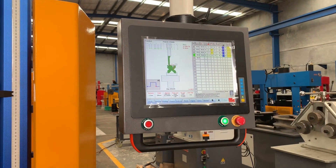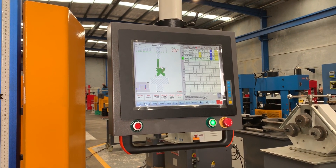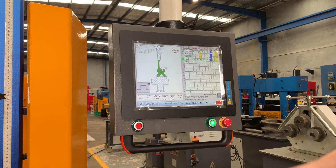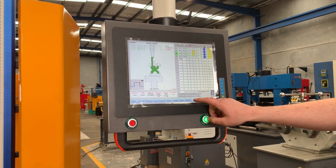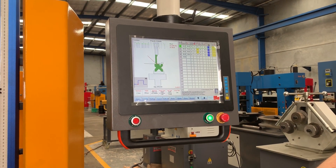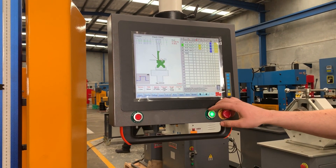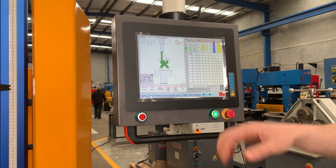As you can already see on the last step, we have an issue with our bend — it's obviously trying to bend something that's already bent into the V block, so we know that's not going to work. There are a couple of ways around that: modify the lengths of your drawing, use different tooling, or as a last resort modify the bend order. In the drawing, the black line is the pre-bent section for that step and the red line is the bent section. We need to keep an eye on those because if something's going to crash after it's bent, it can do damage to your tooling.